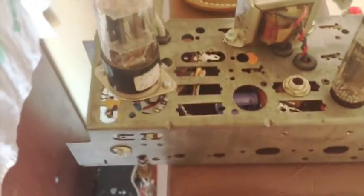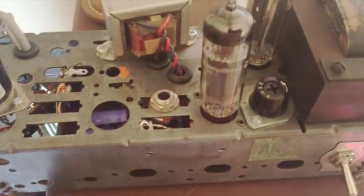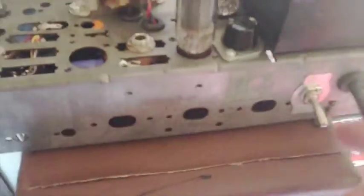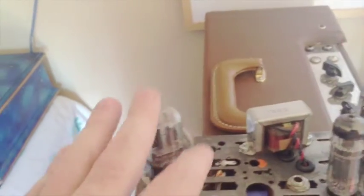We'll do a little demo in a minute — it's sounding pretty good. It looks a bit messy because the chassis had many holes in it. I fitted an output jack for the speaker. This radio never came with a fuse, and it had a two-prong plug, so I've converted that to a three-prong. I put a power switch in — I didn't bother with a standby because the 6CA4 has a slow turn-on rate, which gives the other valves time to warm up at a steady rate.